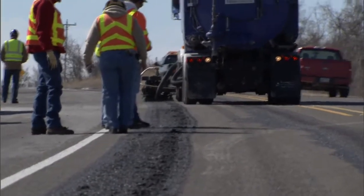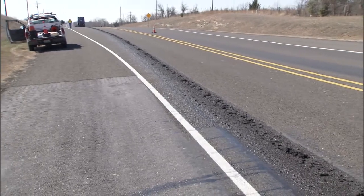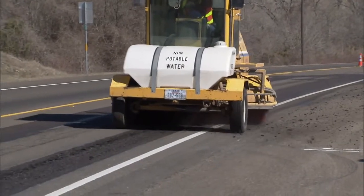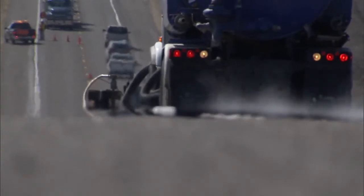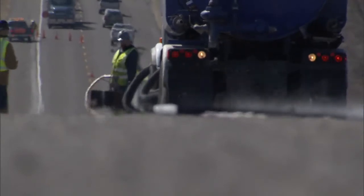There are several different ways you can treat a flushed sealcoat. You can try to strip seal again, but you're not always guaranteed that'll work because you're just putting additional asphalt on and it's real finicky. You could also level up with hot mix, but if you've got too much underlying asphalt it will come up through the hot mix and cause it to rut. There are several treatments we can do that are more expensive and not always guaranteed to work, so that's why we were looking for something that didn't add additional asphalt to the roadway.